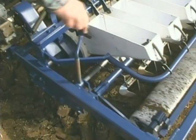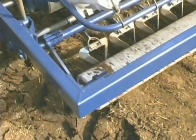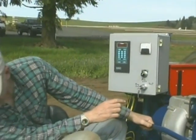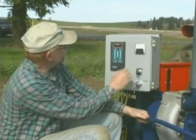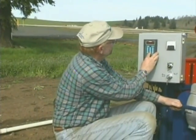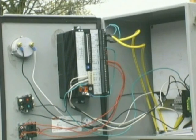He can adjust the depth of furrow, he can adjust the covering of the soil, and he can adjust the pressure with which the seeds are compacted into the soil by the rear roller. All of these things are within easy reach of the operator. Let's go back for a moment and talk about this computer which controls our seeder. This is not the PC that you have in your home — this is a very heavy industrial type computer which is made to operate in the worst of conditions.